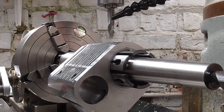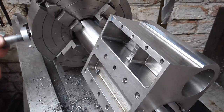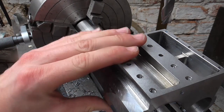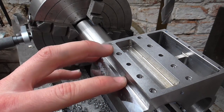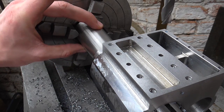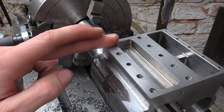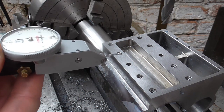There's quite a bit to it but we'll stick to milling for today. The checks I'm going to do before we begin are to make sure the component is set up right, because it's all very well doing alignment checks on the dividing head and the tailstock, but in the end what matters is how the component is sitting in relation to the machine's axis. There are many ways it could be off: the dividing head setup, how well I've clocked the mandrel in the four-jaw, how accurately the expanding mandrel is made, and how accurately the bore is positioned to the datum faces.